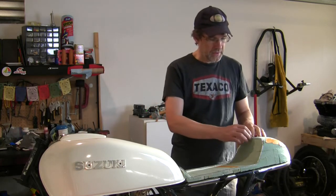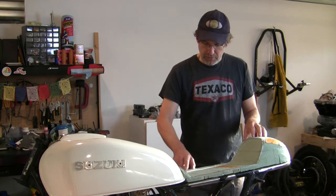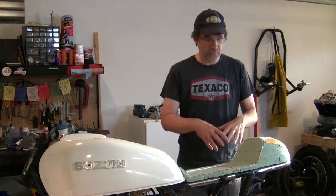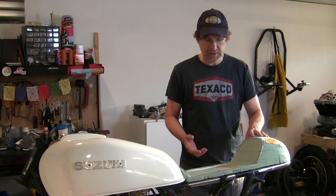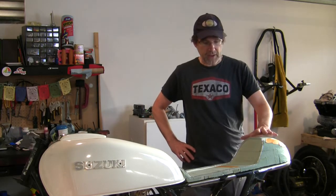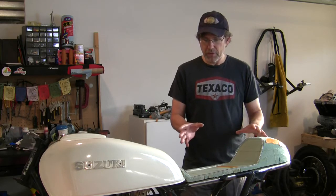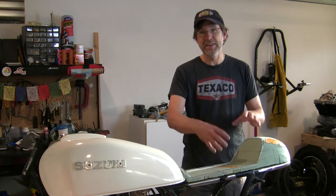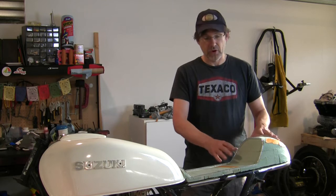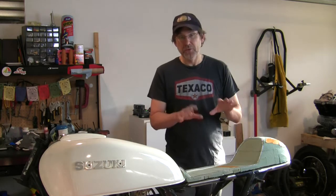Wardrobe change on you — a different day. What we've finished off is the ridge around the upholstery with that vinyl tubing, and the hot glue has worked quite well, much better than tape. So I've removed all of that tape, which was having a hard time sticking to the very dusty surface of that florist foam. And so now I've got the shape pretty close. Ultimately, I want this to release easily from the fiberglass, so I need it to be smooth. This is such a porous surface that I would have a hard time. And again, this is my first seat, you guys.